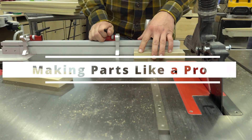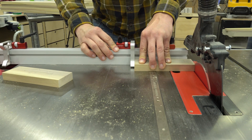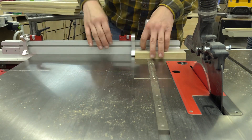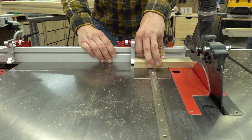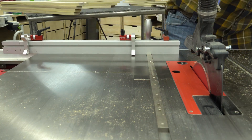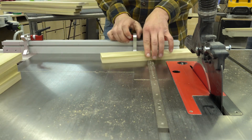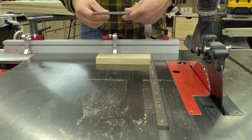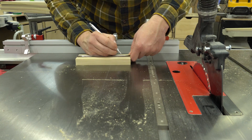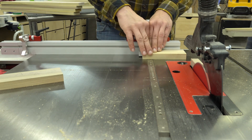So when making cabinets, you're making a lot of parts — maybe even hundreds. And keeping track of them is not hard because I label everything, but making them is a little more involved. The way I do this is I mark out the parts roughly on my stock, leaving an inch or two in length, and then I rough cut everything. At this stage everything is different lengths, so what I'm doing here is trimming one end square. I then group all the parts to be cut the same size, mark my final length on the first part, and using the micro adjust I sneak up on that length. Once I have it, I run all the parts of that size and I'm done. Simple as that.